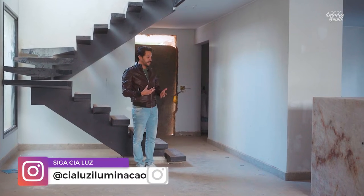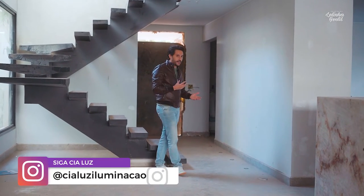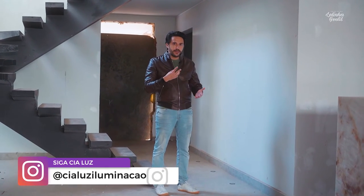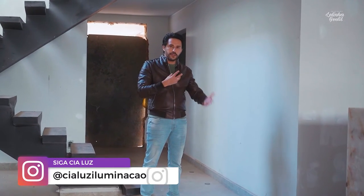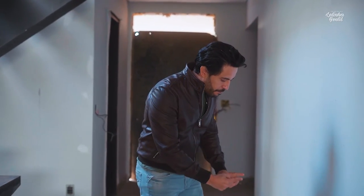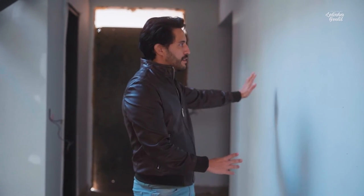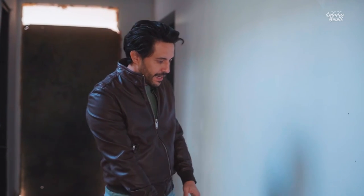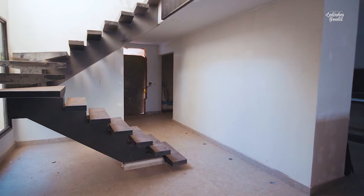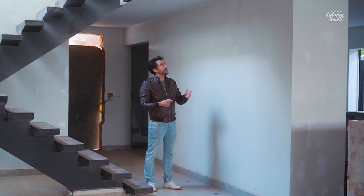For the house entrance, we worked with a ground-recessed profile luminaire specified to withstand both water and dust. Again, the idea was to bring the light in a scenic way — the focus is very tight at 12 degrees. Since we will have a slatted wood panel here, this luminaire will sweep across and graze the panel, exploding the illumination upward on impact.